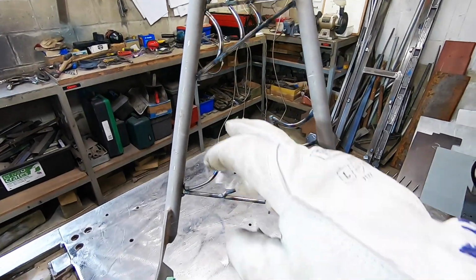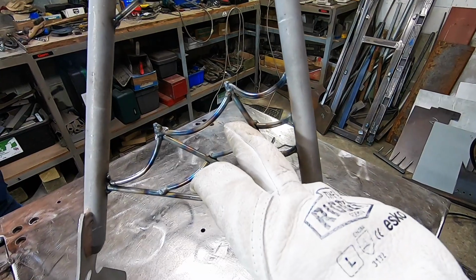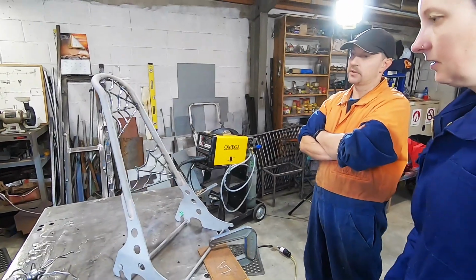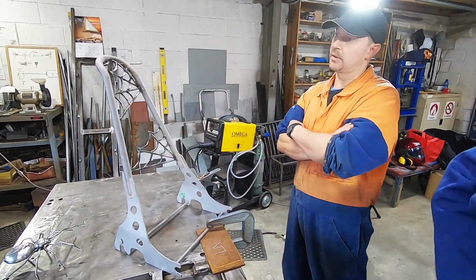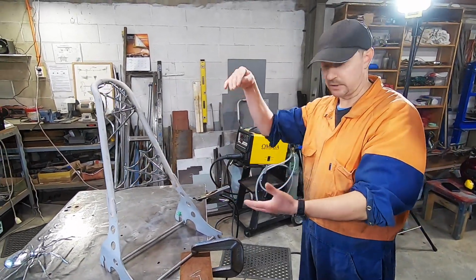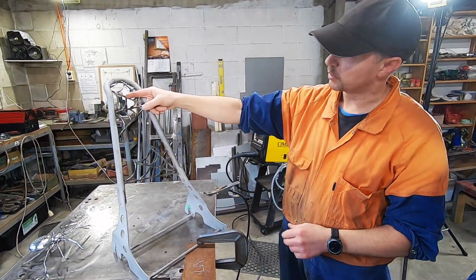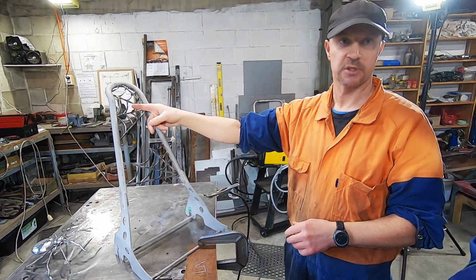So today, on the front side here, we need to fill in these spaces, don't we? Just one thing you need to remember when you're doing positional welding is that you are going against the gravity. Having it lying down, everything just sits as it is, but with the molten pool, it can start to drip down, just because it's standing upwards.